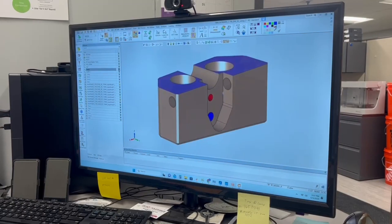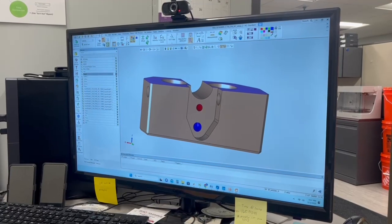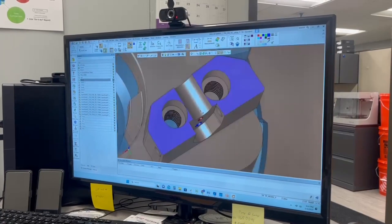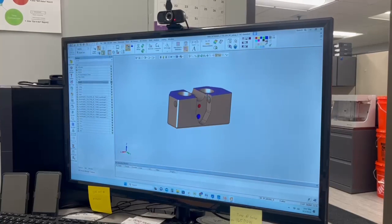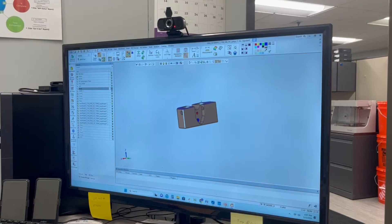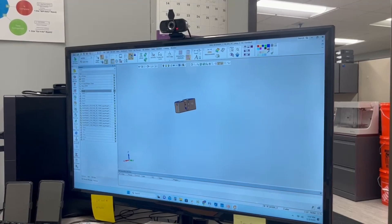Here is the insert in CAD, and I want to show you how much there is to it. We have these small little holes — a 47 thousandths diameter, a 62 thousandths diameter, and two 2-56 holes that are tapped for set screws. Then we have jack screws for the counterbore holes that bolt this insert down. There is a lot of work into these little parts. Let me walk through our process now and the mindset of using the 5X factor to make this happen.